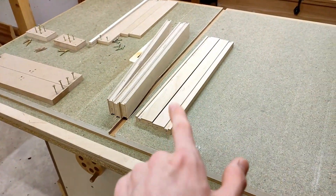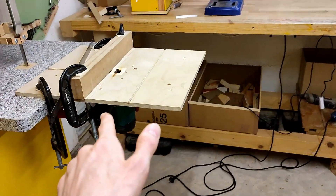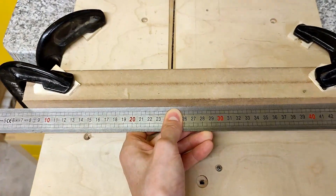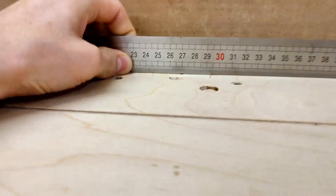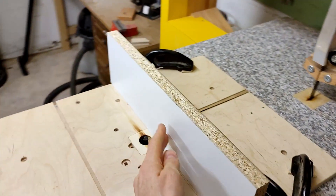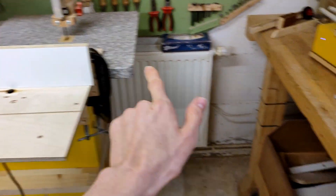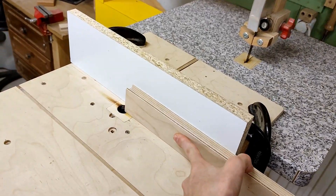Here we're done removing the material. Moving on to the dovetail bit, I'm actually going to do the Y axis first, since for the very reason it required special treatment earlier, it is now easier to work with for the final slot. But prior to that I need to do some modifications to the router table, since I noticed the fence is slightly curved and the surface of the tabletop itself is slightly concave — and that's not exactly the kind of thing I'd like to transfer to my linear rails. I ended up making an entirely new fence, which is now pretty much straight and a lot taller than the old one, to allow for a proper featherboard to be attached and provide sufficient support for the upright pieces to be routed properly.